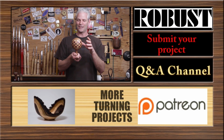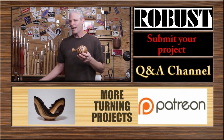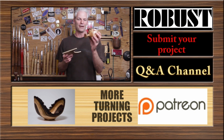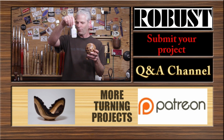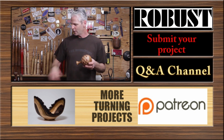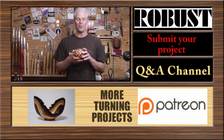There we go. It's about 4 inches in diameter and about 6.5 inches tall. And in hindsight, I should have done this stand separate. I have this little jig that I move around it to make sure it's true, but it's a little difficult with the stand on it. So next time I'll make it separate. And for the finish, I used the Easy CA, the slow activating one, and it worked nice. I just put on one coat and then I just buffed it up with the ultra gloss. So it worked nice. I'm still learning segmenting, so I'm just kind of working my way through it.